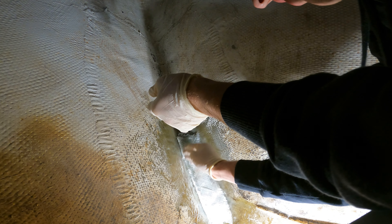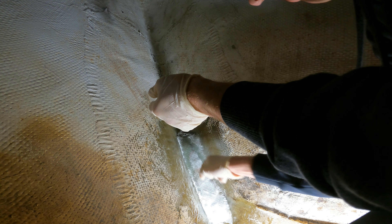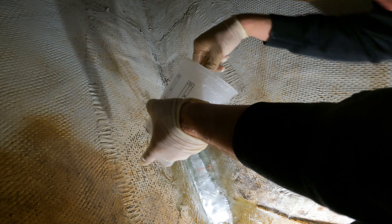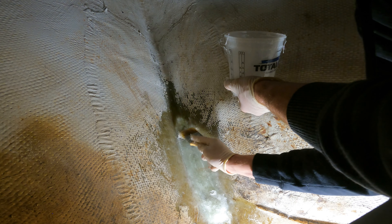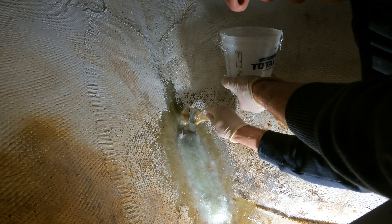The epoxy is very hot now — if the steam wasn't a sign enough. We can use some thickened epoxy to fair it out to be exactly flat, or even fairing compound. Not to worry if this isn't exactly flat. I got as close as I could because you don't want it to be all thickened epoxy — something that hard is brittle. You want the flexibility of fiberglass. Holy moly, that's hot. Now I need to soak this in epoxy. I think I have just enough left for this final job. If a storm tears apart this boat, the one thing left is going to be this piece of fiberglass in the V-berth — and you kind of want that, because it's going to be helping hold up the mast in storms and taking some of the load from the headsail as well. So you do want this to be just rock solid.